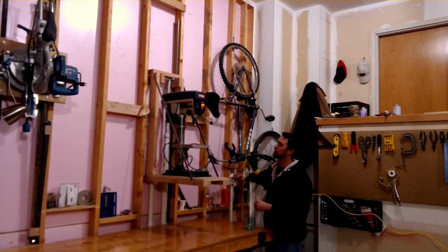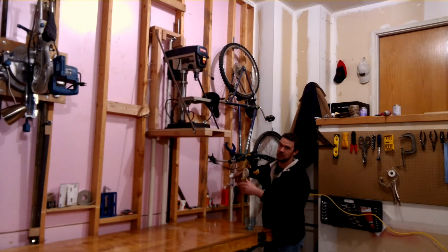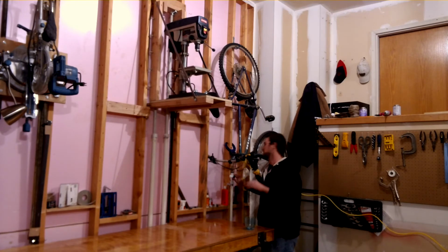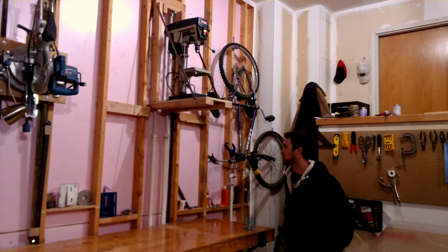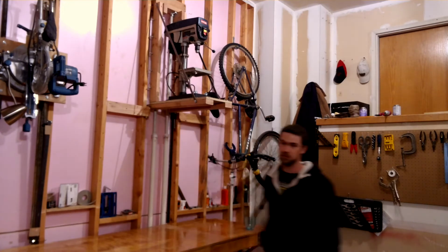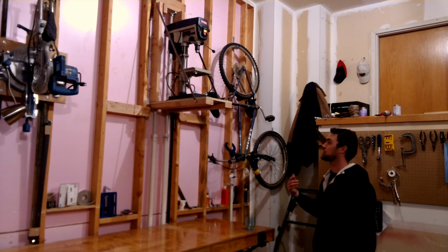And as you see it going up there, the little paddles are moving with those bolts sticking out of the side. It's kind of a safety feature that I put in. And when it hits the stop at the top, I turn the air off, I unplug it, and then I let the air out real slow. And then it comes and rests on the stops right there. These two blocks are resting on some grade 8 bolts that I got bolted through the studs. And that's how it'll sit, and then I can fold my table up and park the truck in.